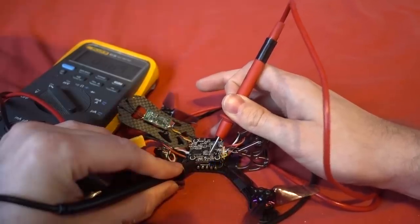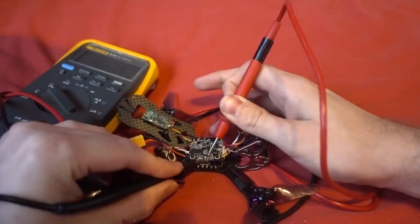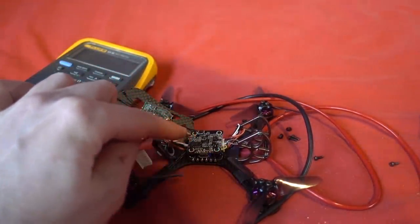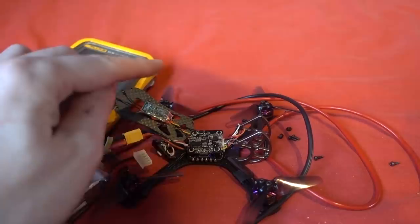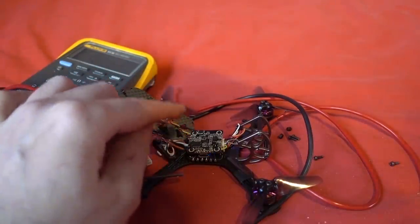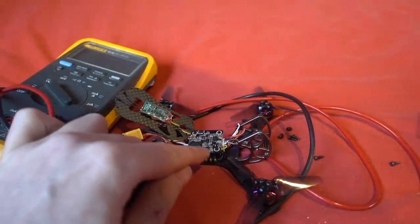Shaky hands. Oh, 5 volt. So yeah, it's actually using the onboard BEC, which is rated at 1 amp. And I think at 5 volt, the mix uses 700 milliamps. So, oh, it's going to be a close call. I think I might try it, you know.